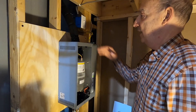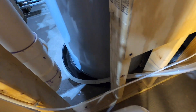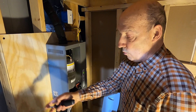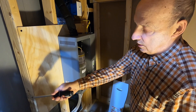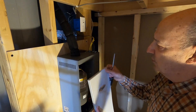It's like having a pot on the stove and immediately injecting it into the airflow upstairs. We've got a drain — it takes a sizable drain because it does flush water. It's constantly finding the optimum water level, so it will drain water. We have hot water in this so we don't want to drain hot water directly — it will actually mix cold water in so we can just drain it through a plastic tube. You can follow the clear tube all the way around to the floor drain. I put a 90 degree fitting on the end so it doesn't end up on the surface of the floor.